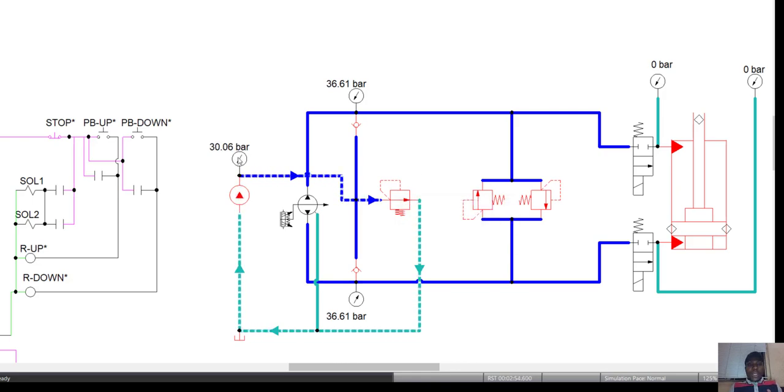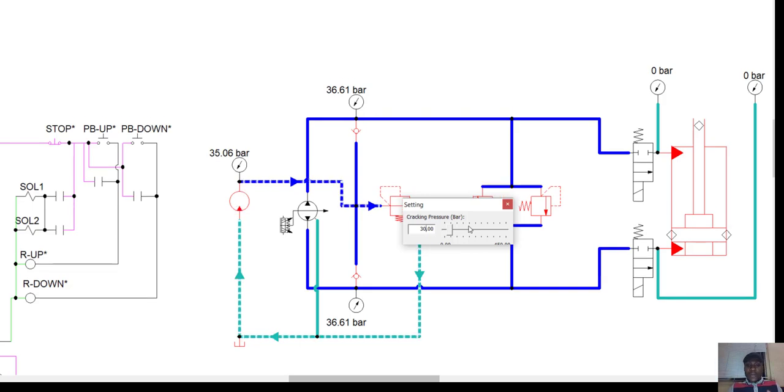In order to regulate the pressure of the feed pump, a pressure limiting valve is here, set to 35 bar. This keeps the pressure on the line at 35 bar. If I adjust this to 30 bar you will see 30 bar on the line. It's safe to use between 15 to 35 bar for your feed pressure line, as long as you have a very good flow.